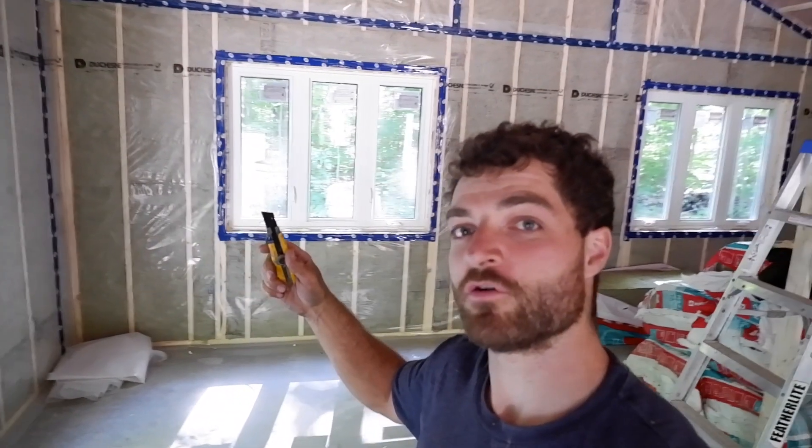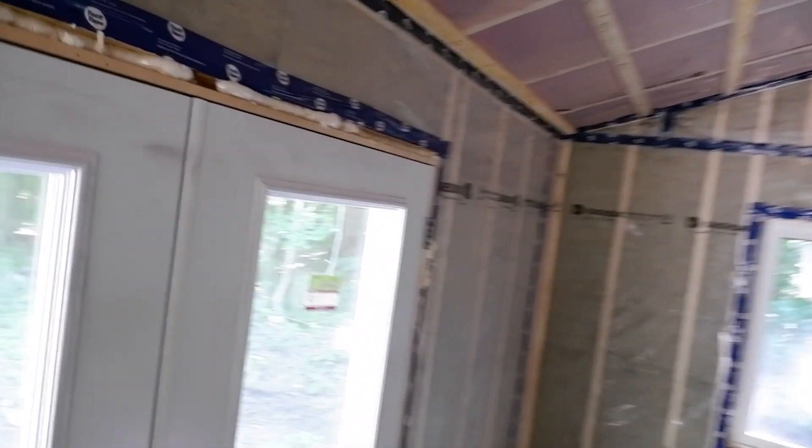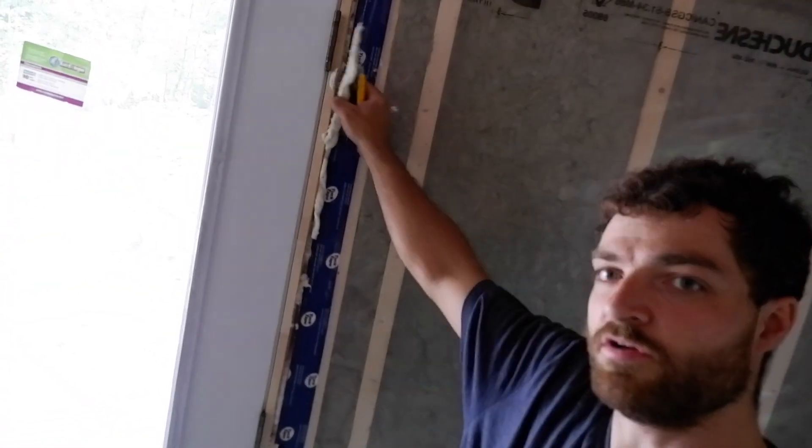I went ahead and strapped some of the ceilings. I'll have to come back and finish up when the gas guy is done. The spray foam has set up now — it shouldn't look like that in one spot, that's a little too much squeeze-out, but everywhere else it looks decent. I'll go along with my knife, slice it off — pretty simple. Go around, cut off any squeeze-out, and that'll be it. So I'm going to do that cleanup, and that'll be it for the day. Thanks for watching and I'll see you in the next one.